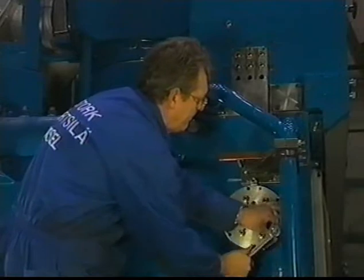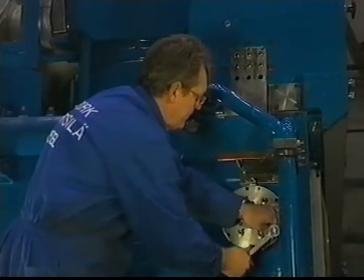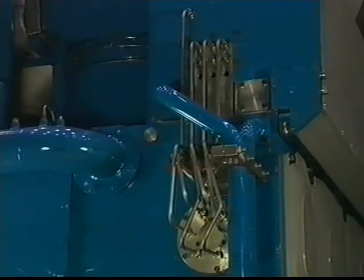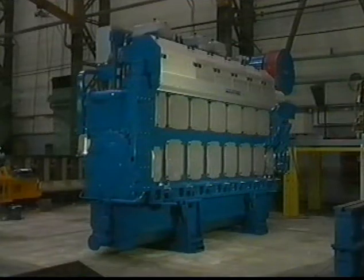Tighten the distributor and connect all pipes. Blow compressed air through the pipes in order to prevent pollution of the system. When all pipes are connected, the protecting plates can be remounted again. Before starting the engine, carry out a lube oil inspection on the parts that have been dismantled.